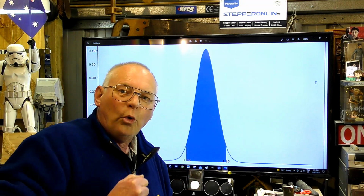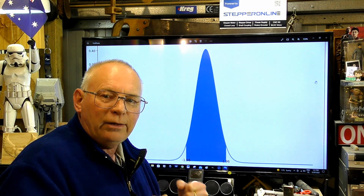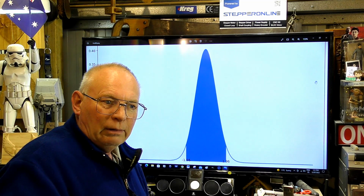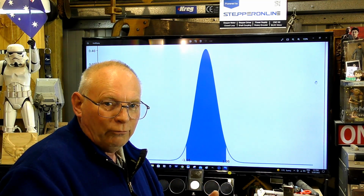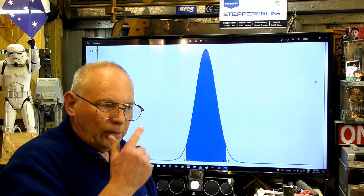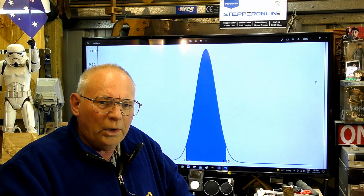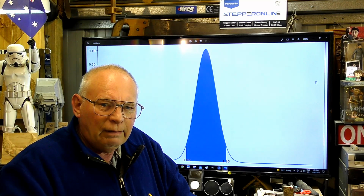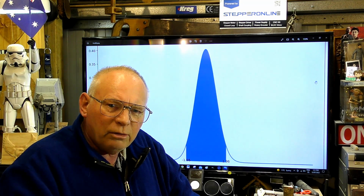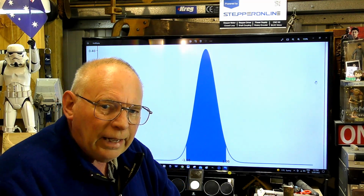So where I'm going with this is to try and explain to you how I'm going to do the next series of videos, and I want you to have some understanding of, well, if the beam is 0.19 of a millimeter, how are you going to get a dot size smaller than 0.1 of a millimeter? It's all to do with speed and time.